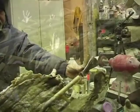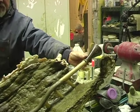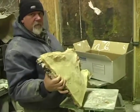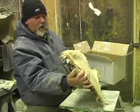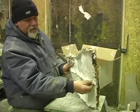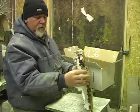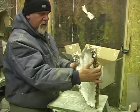Also made of wax. It's then later on attached here. And all of that will then be encased in a plaster and sand. When the mother mold section is pulled away from the rock, first of all you can see that it's very thin. It's not a very heavy mold with the burlap reinforcement. And we make ribs with the burlap to create a stronger kind of section.